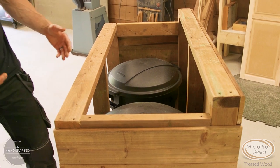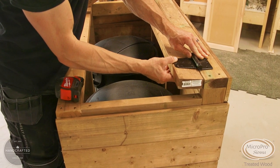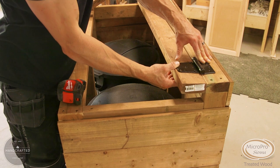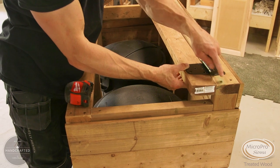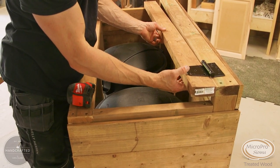Let's move on to building the lid. In order to make this lid work it's going to have to line up to the hinges. What I'm going to do is butt two two-by-fours side by side and have it rotate in this direction. I'll cut this two-by-four the same length as the other — 48 inches. I'll have one for the front and one for the back and then put ribs in between to frame it all together.